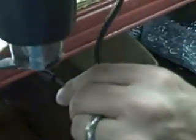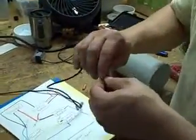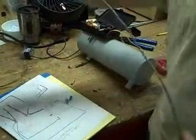And the tube will shrink right up. Okay, we should probably be using tubing that's a little thinner, because you can see it's not fully shrinking down. That's about as small as this tube is going to go. Works fine for the middle part where it's thicker, but on the actual ends, it's not quite thick enough. So in this case, if you're working with something like this, I might take some electrical tape, which I'm not going to do right now for the sake of saving time in this video, but basically put a little electrical tape on each end just to tighten it up.